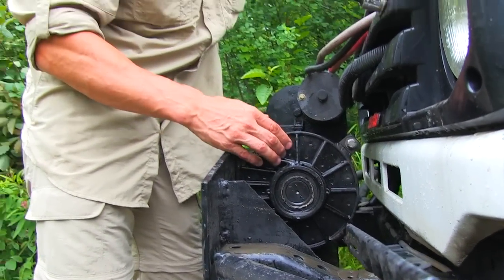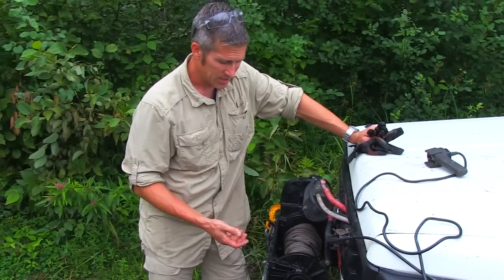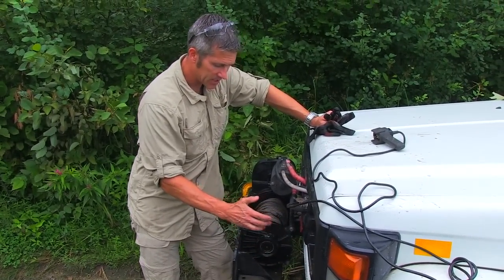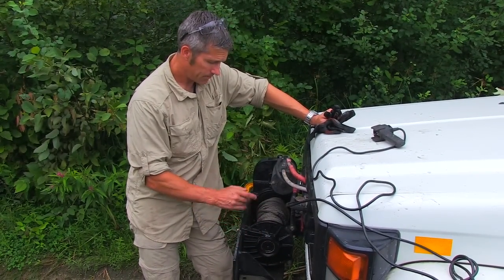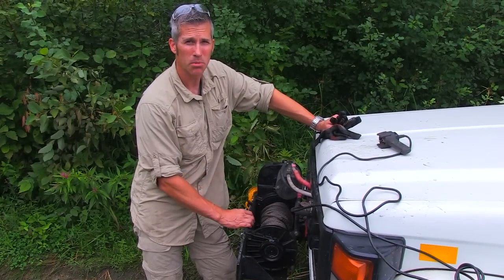With the old end plate, it's not even a friction fit — just a loose fit with some grease and a nylon bushing. I don't really like that, so this is a press fit, everything is nice and tight, sealed bearing. It doesn't work too bad — I'm pretty happy with it. Overall this is an awesome winch, I love it. I've pulled pretty hard with it and you can see that in a couple of my videos.